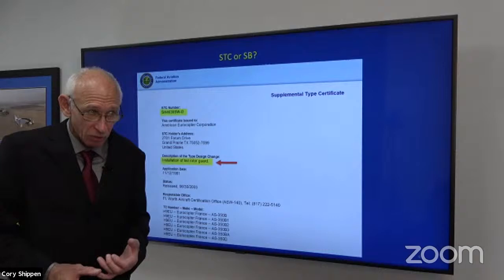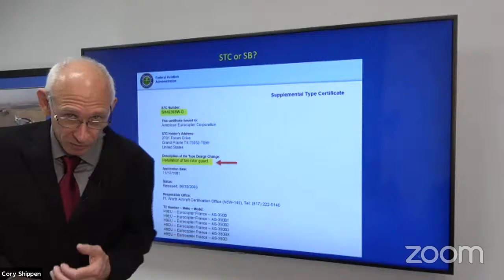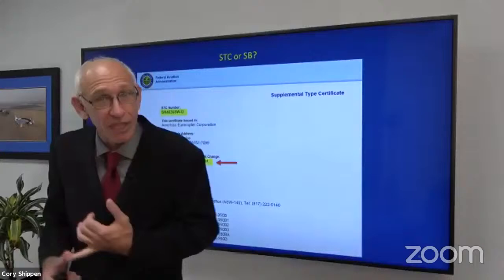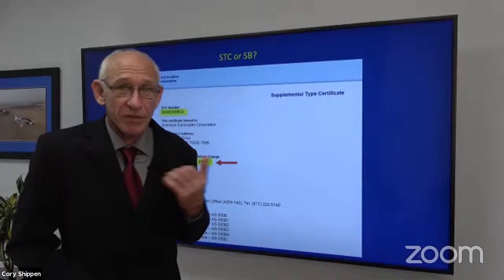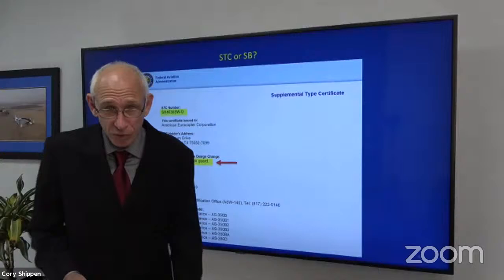We're talking about follow-on maintenance instructions, right? And we're going to talk about that too. If we have an STC, a lot of acronyms, I'm sorry for folks around the world if you don't use these same acronyms, but if we have an STC, we're going to use something called an ICA, or instructions for continued airworthiness, right? That's where we would go. If it's a factory option, we're going to go to our MSM, or master servicing manual. Okay, so two different places. And where we get our information, again, it's pretty important, right? The torques could be different when we look at things, how we look at things, all of that.